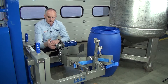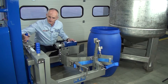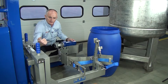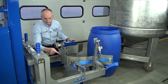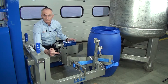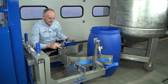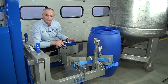Now looking at the close up of the head, so these arms can move in and out. If I move this I can move these in and out, the same with this arm, this also moves in and out. Now this band you can adjust from this position into these holes here, so if these pins are in this position for 205 or 200 litre drums, this one will be 180 and that will be 120, that will be 100 and then down to 50.